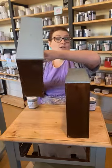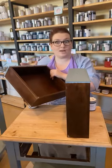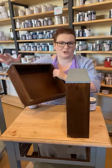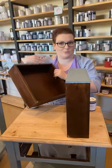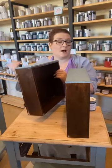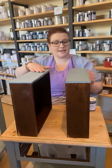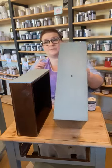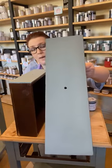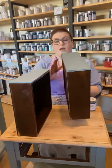That's two coats, and I've very lightly sanded it after I finished. It was quite a warm day when I painted this and the paint was drying like crazy. So I did give it a light sand — I don't always. It is up to you whether or not you sand between or after coats. This one has been waxed — you can see it's got a very, very slight shine. It's been waxed with white wax and then with black wax.